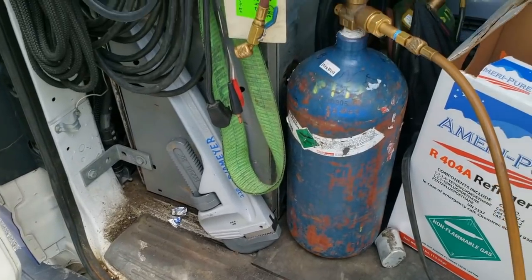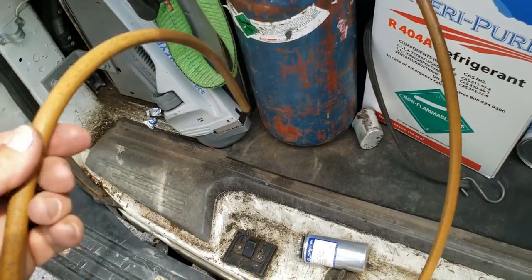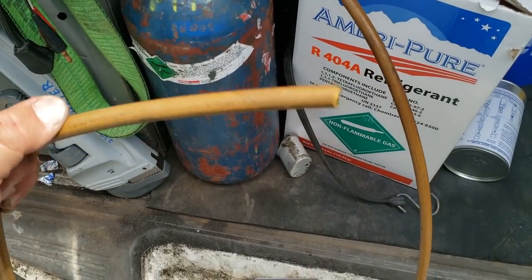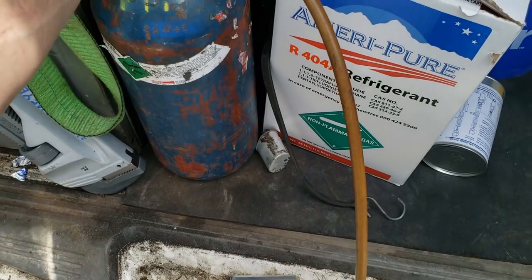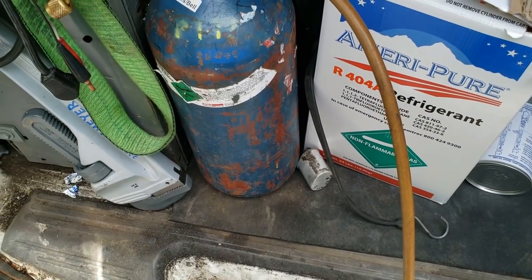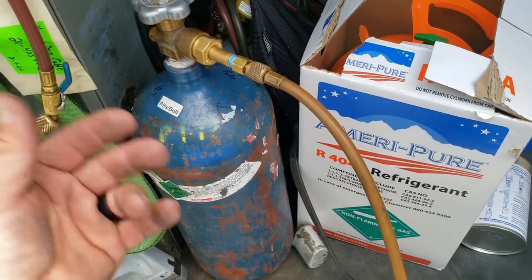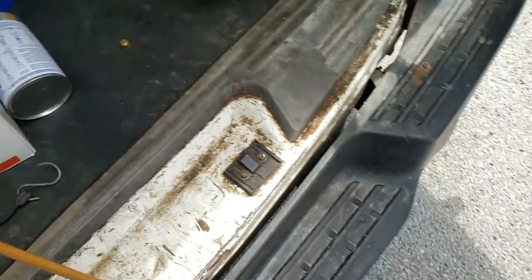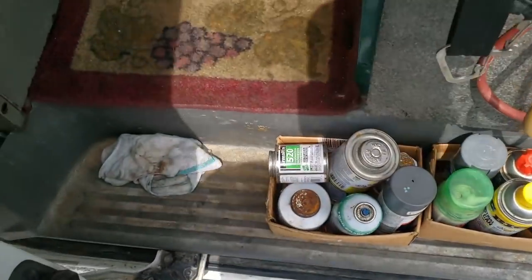Went over there to try to get out the door but can't get out the door. I've got an adapter here — this could be very dangerous, so I don't recommend doing it. The reason I use a hose is it doesn't have an end on it; otherwise, the regulator cranks it down so low and slows your flow down to the point where it just doesn't come out fast enough to really get a coil clean. So we're just going to blow it out with nitrogen because otherwise we'd have to run a lot of hose through the drive-through window — not dealing with that.